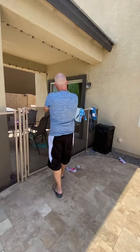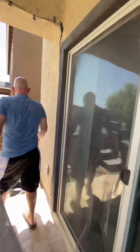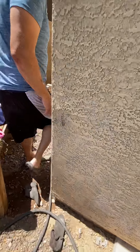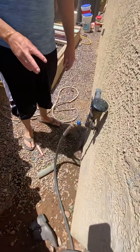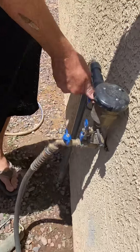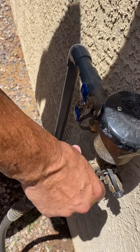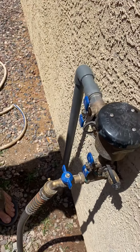We're going to go over here and look at the source for the water leveler. A lot of pools look like this — it's going to be the closest water spigot that didn't have concrete surrounding it. This position is on, this is off — you can do either one, but if this is off it's never going to add water to the pool.